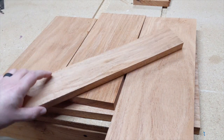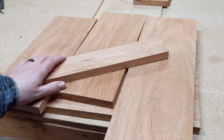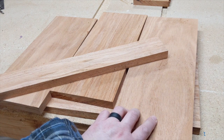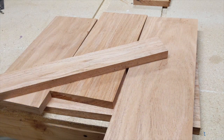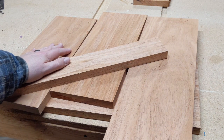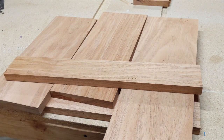As a campaign desk it'll be sloping down to the front height, but we'll take care of that later. Now I have these smaller pieces and I want to plane them down to half inch. So I'm going to start running them through the planer and get them down to half inch.